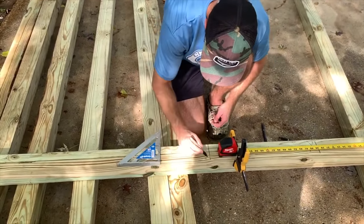Also, I ran electricity in my shed, so if you have electrical, make sure you're using nail plates to protect the wires from any of the ProSlat screws. Now at this point, I moved on to the third wall of my shed, which was the last wall where I could install a full 8-foot length of the ProSlat slat wall.